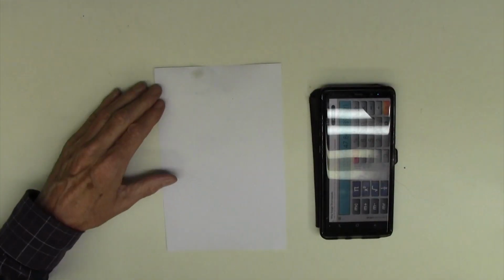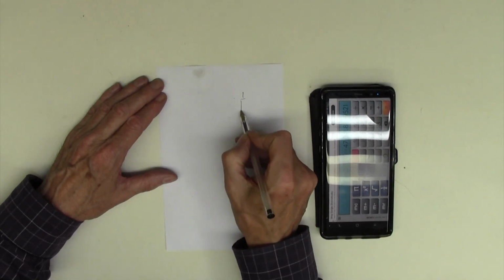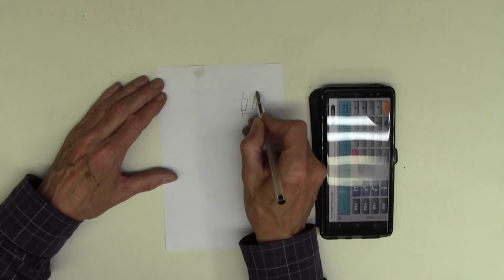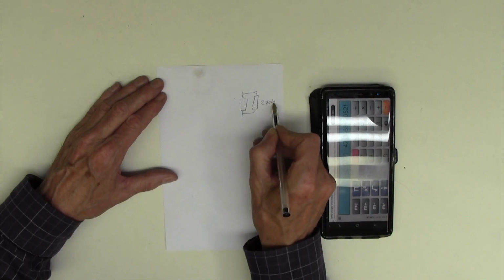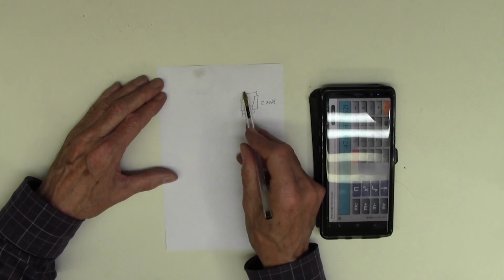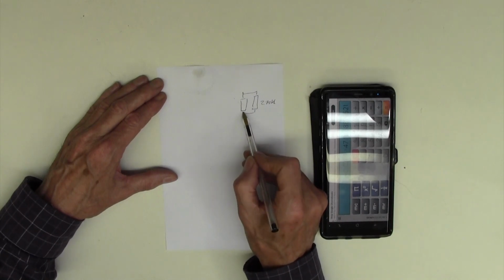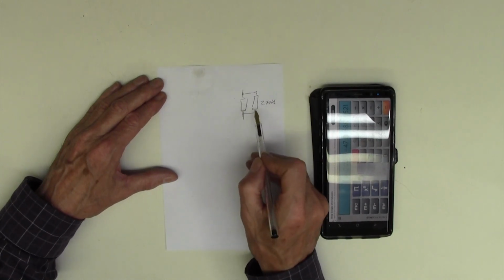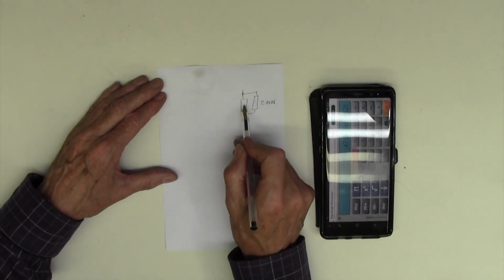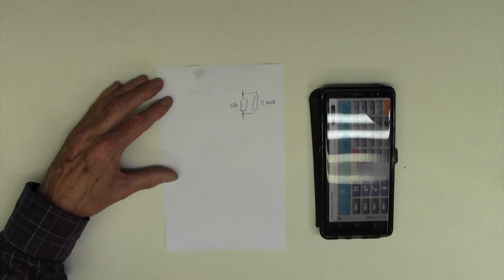Okay, I thought you might enjoy a tiny little bit of theory. We have an existing resistor across which we are going to tack a parallel resistor of 270k, because that's what our decade box said. I could just tack a 270k resistor across there, but why not remove this resistor and put a proper resistor in there? And to find out what the value of the substitute resistor is, we're going to need to do a little bit of Ohm's law here, so let's do that. I measured the existing resistor and it came out at 58k. It's probably a 56k gone out of tolerance.